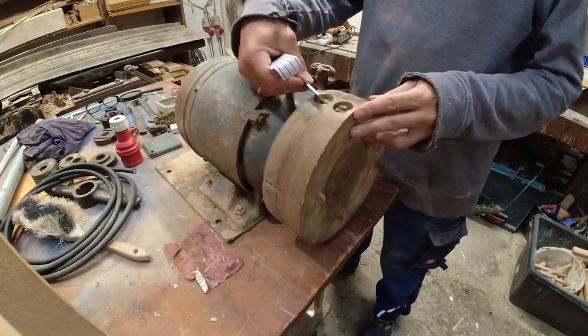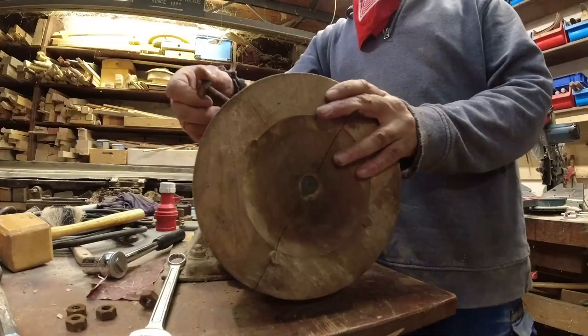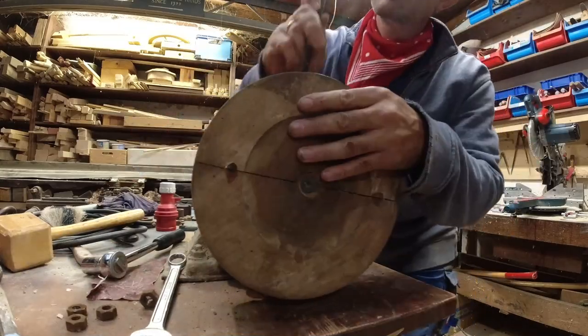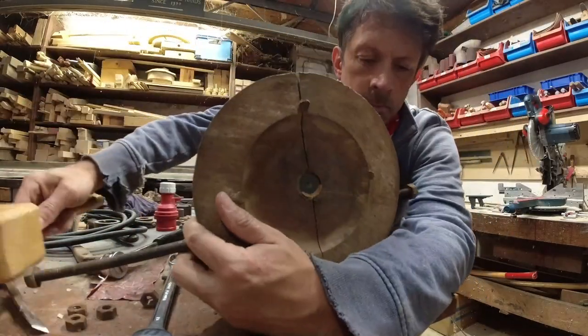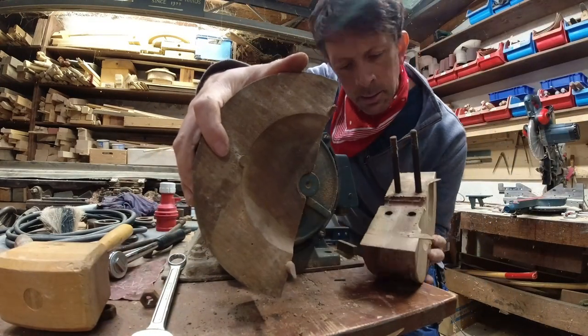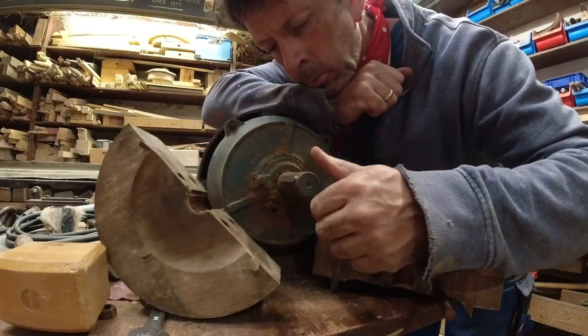The pulley, made of two hardwood parts braced against each other, was particularly worth seeing. The use of wooden wheels here is not a problem, but I couldn't leave this one the way it was — it ran out of true and I would have preferred a slightly larger one, so I dismantled it.